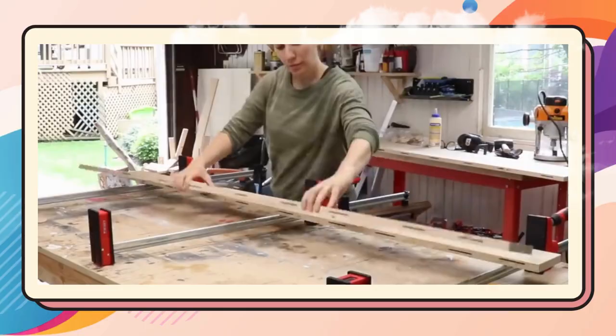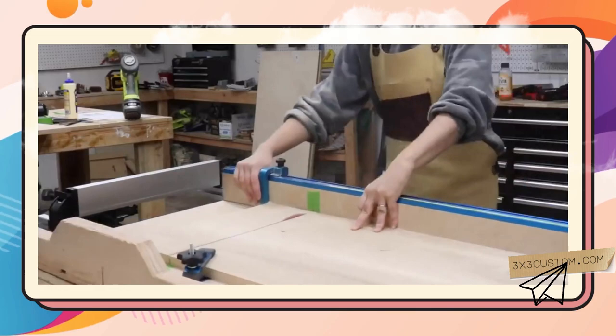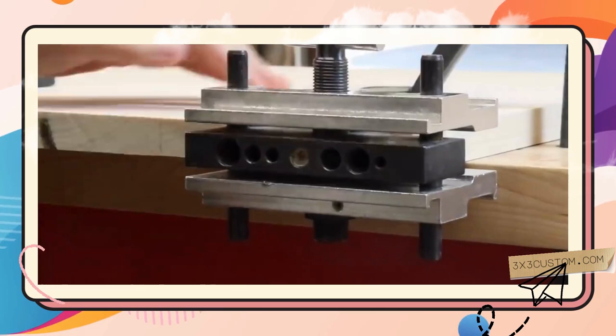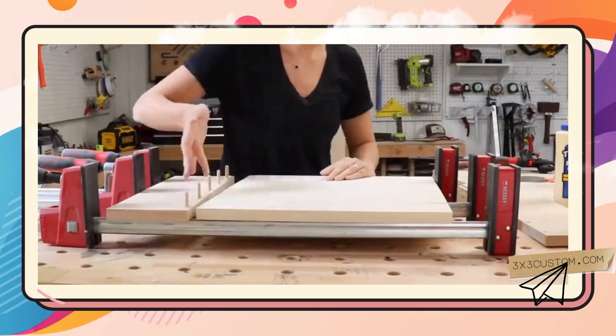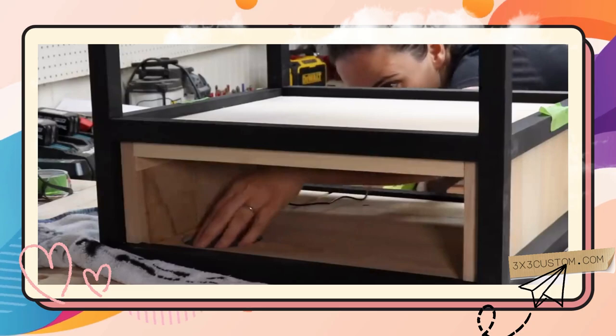Number 11: A DIY Wireless Charging Nightstand — a stylish and functional piece. Start by gluing and joining the elmwood panels with biscuits for rock-solid stability. Shape the wood using a table saw and router table. When dealing with the wireless charger, create a template and carve out a space for the cord. Assemble the main box using tongue and groove joinery, ensuring it's sturdy. Install the wireless charger, grab some 1/8-inch thick plywood to hide it, and adjust your router's depth stop for precise routing. Build the base using poplar wood, secure it to the main box with dowels, and craft the drawers using elegant dovetail joinery.